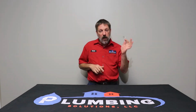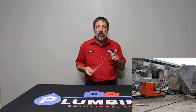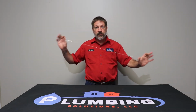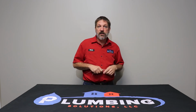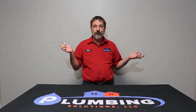Now, cable saws are used in many different applications. Some of my tree service guys have cable saws on their truck that they use to cut limbs with. On the bigger scale, they use it to cut stone, they use them to cut granite. Now these are motorized with very large diamond embedded cables, where this guy's just pretty simple. So what we're gonna do now, we're gonna go out in the training center and we're gonna cut through a 1.5 inch vent real quick, just to show you how this guy works.